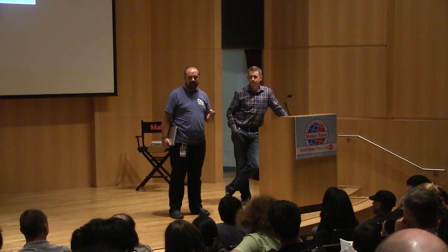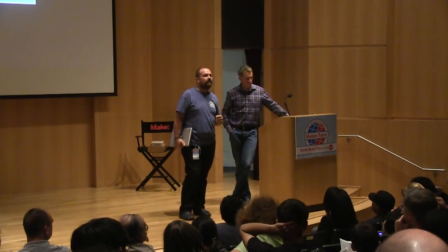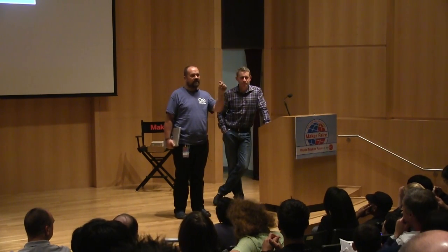The flash is 512K. I'm looking at Dave, yes, he nods. And the RAM is in the region of 64K. I think the usable amount is something like 53 kilobytes. But that's more or less the quantity. The nice thing about these devices is they have quite a bit of RAM compared to the small AVR, so you can actually start processing nasty things like XML files that kind of destroy your memory. So in a way, it's good to have more RAM.